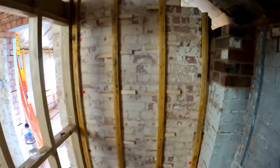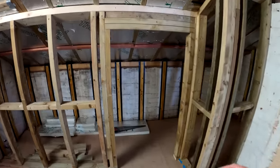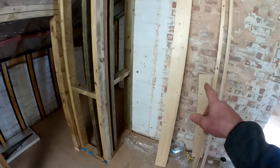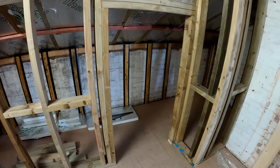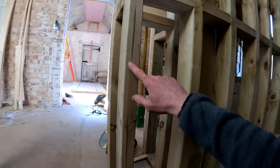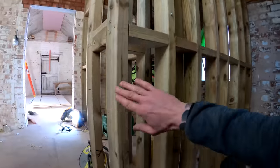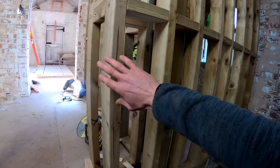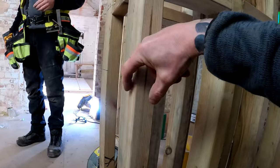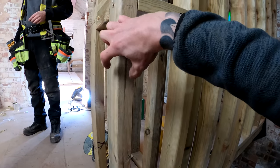Pete has finished getting the baton in, and he's now going to move out here and get the door lining in here. It's a bit of a smaller door because we've got the ceiling to worry about. It's just a standard lining that's going to go in there but obviously be chopped down to height, and then we're going to get Paul Shields to make up a door which will match the rest of the doors in here. Also up on this corner, just to give a bit of a nod to the main house, we're going to put a 45 degree angle on this corner with a nice little scallop at the top and bottom just to soften this corner and mirror what's in the house. So that's going to have to be doubled up here to allow for an 80mm width on the 45 across here - we'll have to whip some of these noggins out and beef this up to take the actual width of this corner.